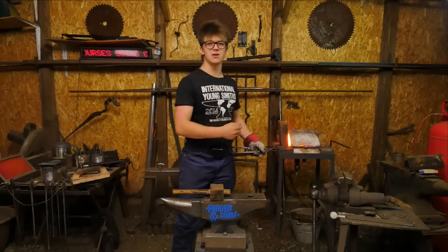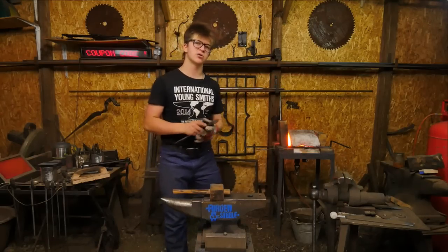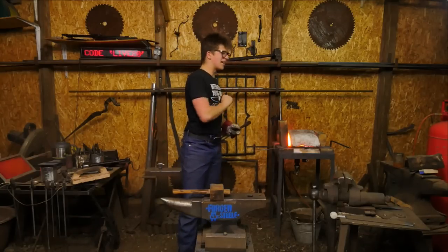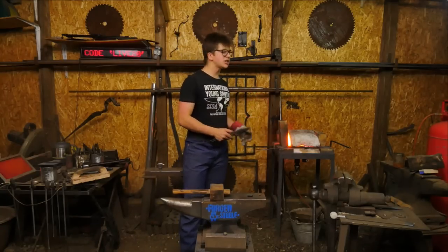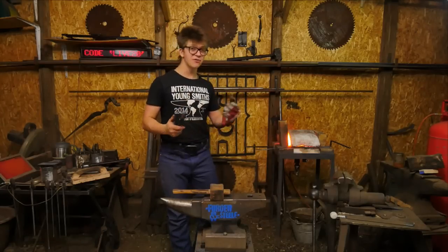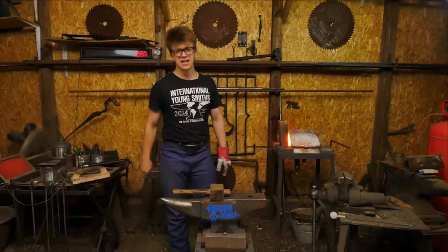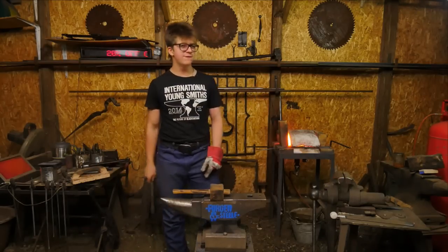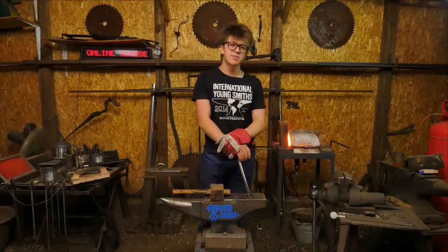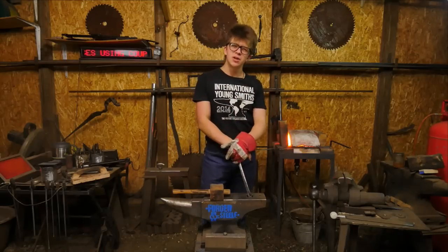It also depends on the size of the orifice, so bear that in mind. It's not all about pressure. It's also about the size of the orifice that you're pumping the gas through, and that is where your consumption comes into play. In this particular case, I'm running it at a low pressure, and the orifice stays the same despite the pressure differentials, so we're using a smaller amount of gas. So right now, I'd probably get 45 to 50 hours out of that tank running it how it is, maybe. That'd be up there to being pretty good fuel economy.